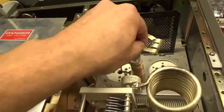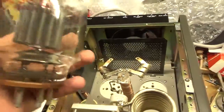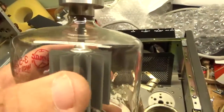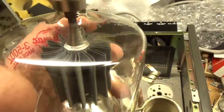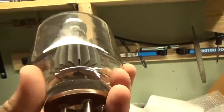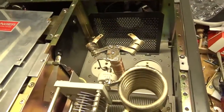Tighten these back up. You can leave these parasitic suppressors in the amplifier when it's shipped — you do not leave the tubes in. This customer purchased this amplifier from someone else, had it shipped to himself, then had it shipped here. Tubes were left in both times, and look how the plate assembly actually snapped the solder joint right there — it's actually crooked now. So this tube is shot.